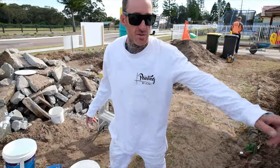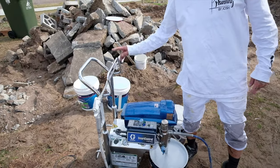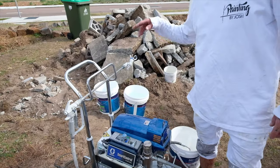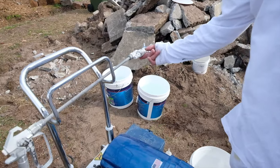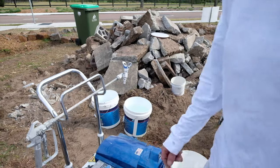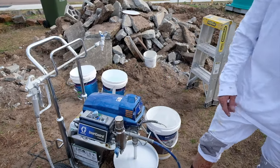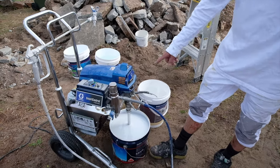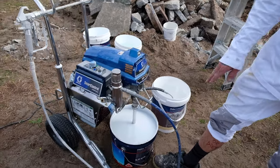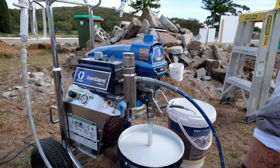At the moment I've set up the 30-meter lead, the 40-centimeter extension on the end. We've got the Graco Clean Shot, the Graco housing tip guard, and the FTX gun. I like running the FTX. We've got the 595 — like I said, we're just running the fluid line. We haven't got the air assist or anything hooked up to that today.